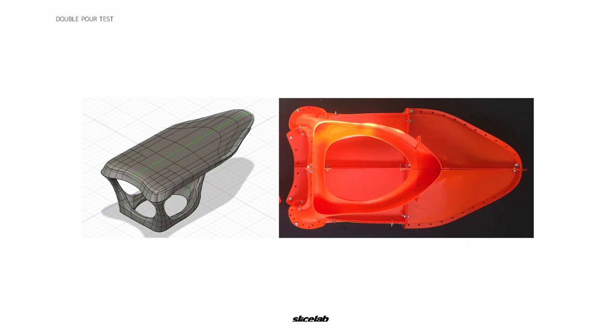We didn't waste any time to jump back into Fusion 360 to create another prototype model. This time we made a flat board that looks like a small ironing board, roughly 24 inches wide. There is one main cavity to pour into that funnels down into three different legs and ultimately to a flat surface. Doing this pour allowed us to learn about hydrostatic pressure. We used two different mixtures that both had super plasticizers, which is a compound that allows the concrete to flow smoother with 15% less water, making it stronger, and is really good for self-leveling concrete.